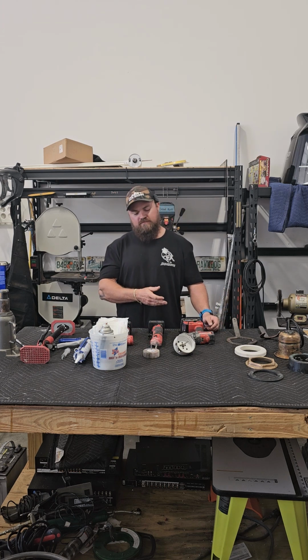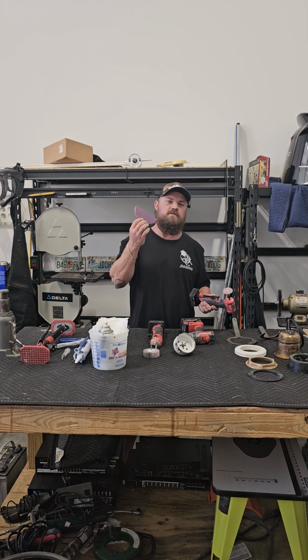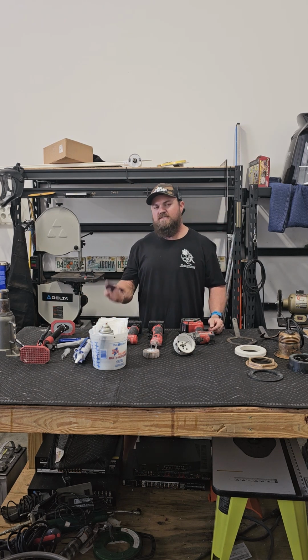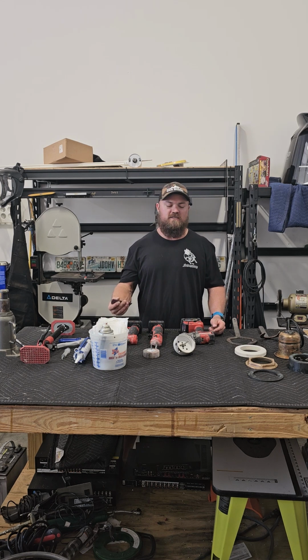After you've drilled the hole, and you enlarge it if you need to, I suggest, depending on your boat, if you have a bottom painted boat, absolutely take a regular sheet of sandpaper or a little grinder, and remove that bottom paint. It doesn't need to be completely off, but at least scuff it, at least scratch the surface so that you give the sealant you're using, I prefer 5200, a good surface to bond to.